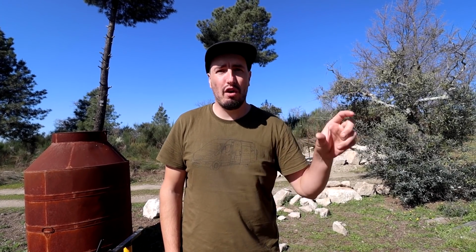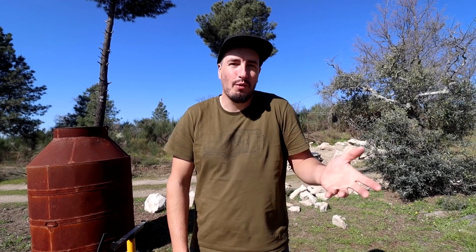Hello. I just crept up on you really quietly. So I've been doing some different tests to see how these lag bolts work, and what I've worked out from research is you have to do 2 different pilot holes, and we're going into a really hard wood. Chestnut is super hard, so you need to pre-drill obviously, but you need to pre-drill the right size holes, otherwise when you're cranking the bolt into the wood it will split it open, and you don't want any splits because then that will harm the structural integrity of the beam.